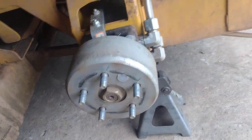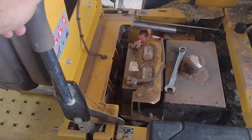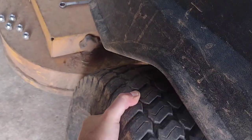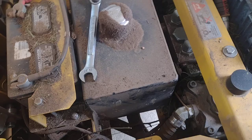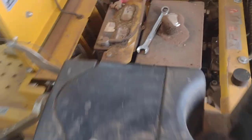Stick the tire back up on there — that was a little heavy. All right, so with the lever in, that's the brake off and the hydraulics disengaged — you can roll it now. And then when you engage the parking brake, you shouldn't be able to turn the tire at all. I've already adjusted this side a little bit.